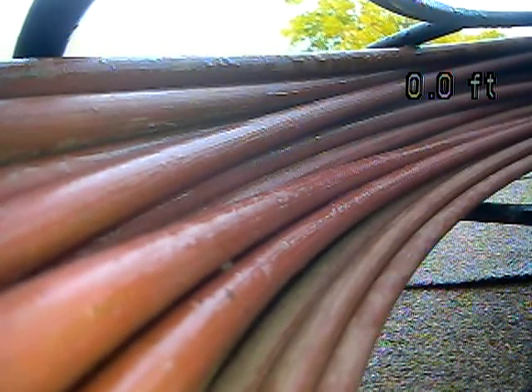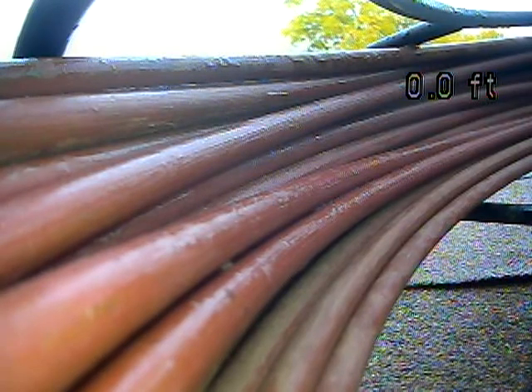So, just to recap, I'm not seeing the entire line. I'd recommend finding out if there's another access point so that we can see the rest of it. And you do have some flat spots which are holding water, which is not ideal and can lead to a back-up. So I'm going to end this recording now.